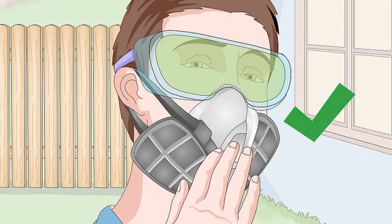Painting a fence. Wear protective goggles and a respirator mask. If you use a power washer to clean the fence, put on protective goggles to shield yourself from the spray. Wear a respirator mask to protect yourself from paint fumes when you paint. Pick your clothing carefully — put on water-repellent clothing when washing the fence, and consider wearing gloves when you paint.